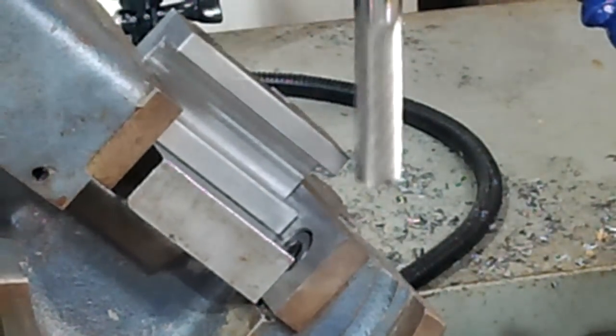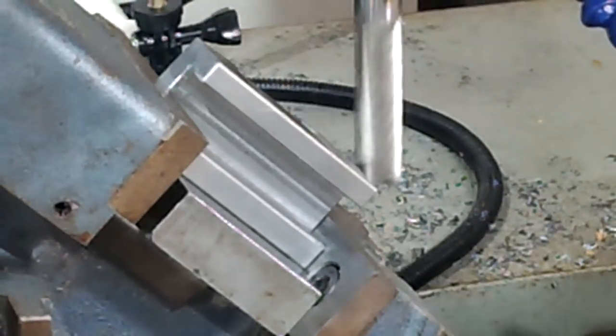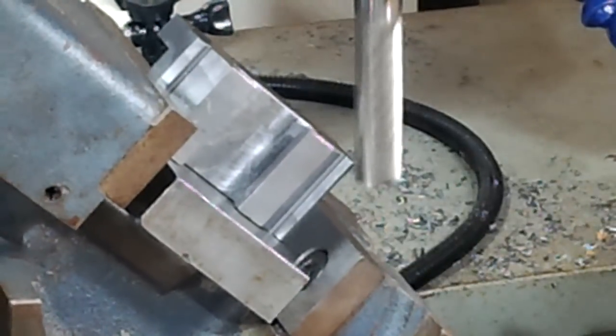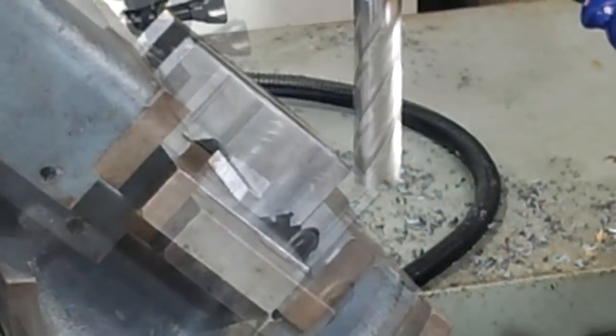This is the time to dress up all the corners by milling a 1mm by 45-degree chamfer over all edges and corners. That's a lot of chamfering, but it does look better than using a file.